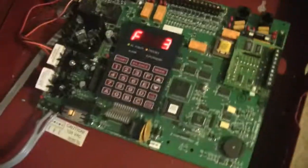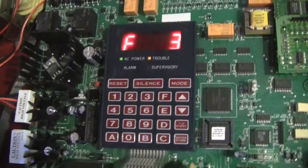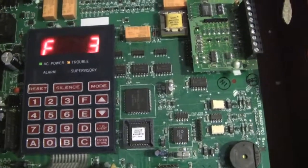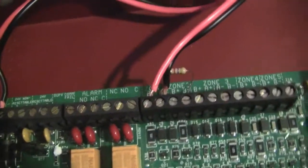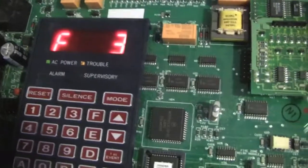There are some more instructions right there, and looking on the board for a quick overview: we have the incoming power connections right there, and here the display and control. We have two NACs, or bell circuits, or whatever you want to call them, some relays in there, and five zones. And here's the stuff for the built-in communicator.